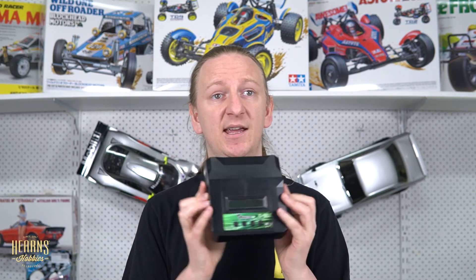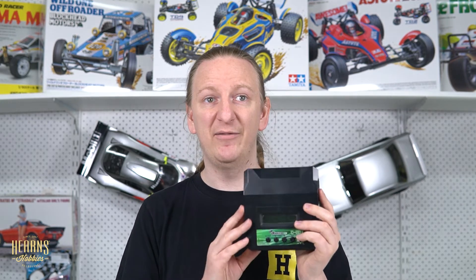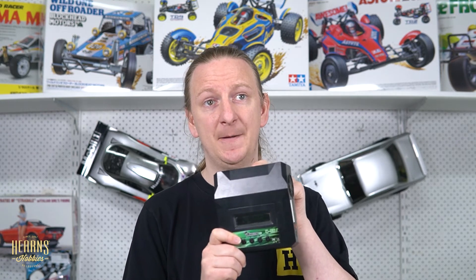The C80 is about 50 watts per port, so it handles twos and threes really comfortably. However, if you start charging 4-cell packs one after another continuously, it will have issues — eventually it will cook the power supply inside. You don't want to damage something you just bought by not knowing, so use that Rapid Tables tool and double-check the wattage.